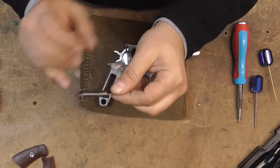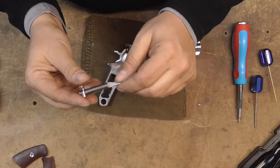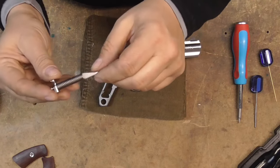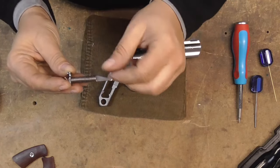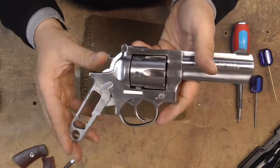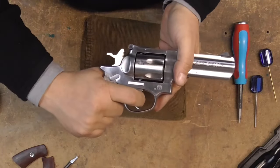You can also buff the body of the mainspring all the way down both sides — makes the spring ride easier. You can also thin the spring on a belt sander; just hit it rather than cutting coils, since cutting coils lessens their inertia. What you want to do is thin it this way instead of reducing coils. However, our buddy here doesn't want us to do that on his gun, so we'll leave the spring as-is.